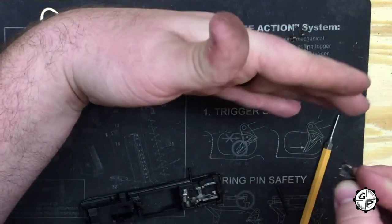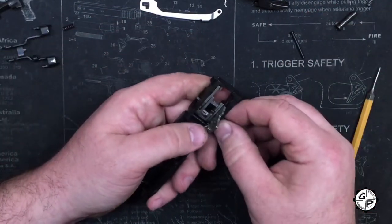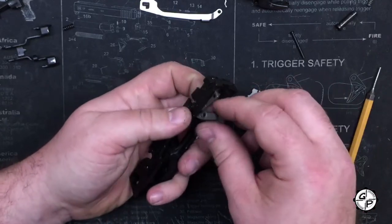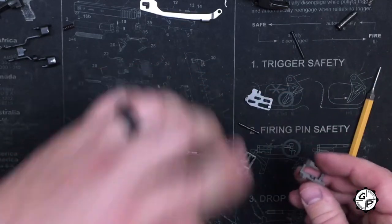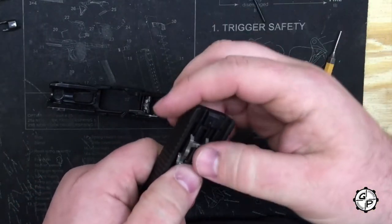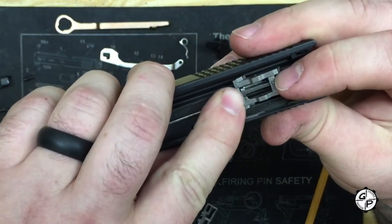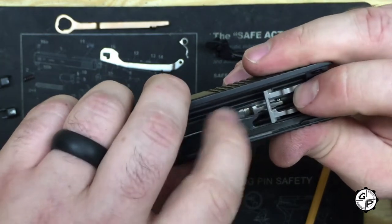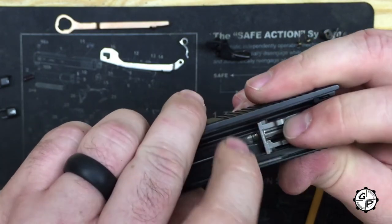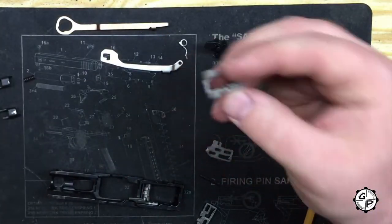It's essentially a sear return spring, but mostly what it does is — you can see the cutout in the grip frame where that spring seats — it makes sure there's proper tension and pressure on the entire chassis so that it seats properly inside, because the sear spring will actually spring it back on its own. As soon as you pull this pin out, the actuators are going to come out as well as the blocker. This is your blocker. Here's how it's interacting — it's just grabbing right there on the striker. What's going to happen when it goes to shoot is this cams out of the way, releases the striker forward, the slide comes back, this is cammed up, grabs it, cocks it, and it's ready to go. That's how the blocker in the Ruger American works — it's a camming blocker, not an actual blocker in the slide. It's actually a pretty brilliant design, very simple and very effective.